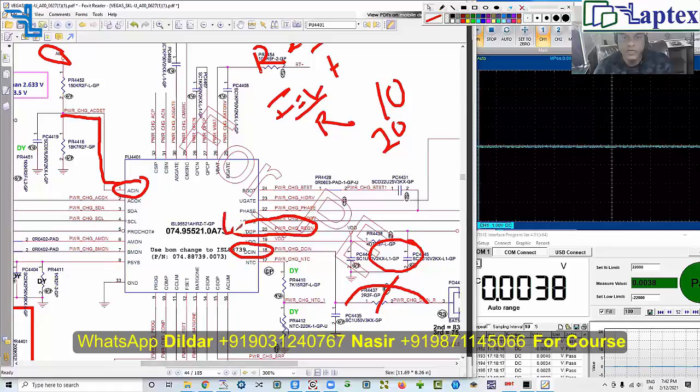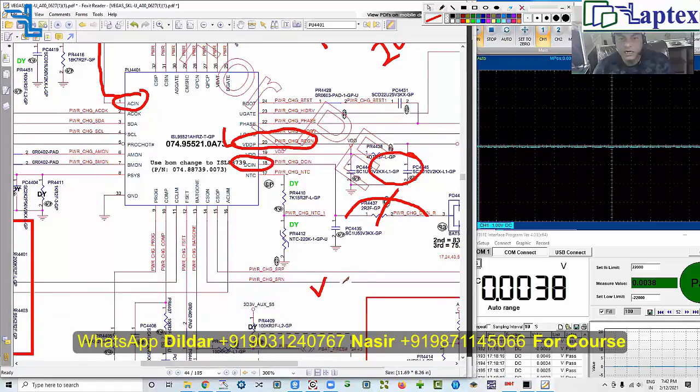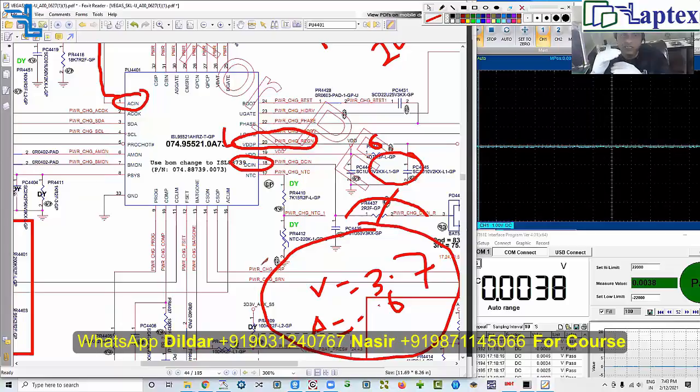This VDDP is the first LDO you get on the motherboard before the 3.3V and 5V. The condition is: if DC-in is greater than 3.7V and AC-in equals 0.6V, it will exit the over-voltage or under-voltage lockout, and you will achieve 5 to 6V at this point. DC-in is the ratio here — even though I was setting 17V, I was not getting the DC-in voltage on this point. You achieve this LDO voltage from the charging IC.